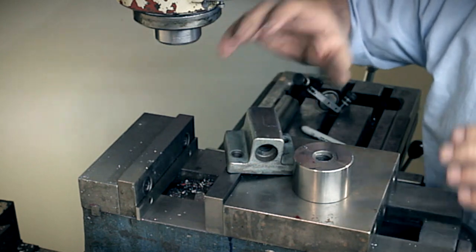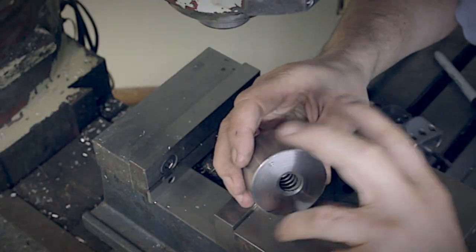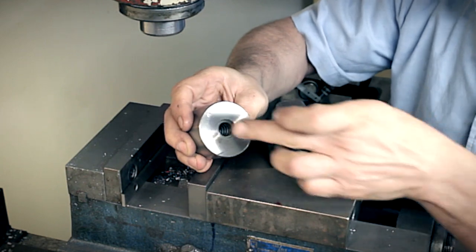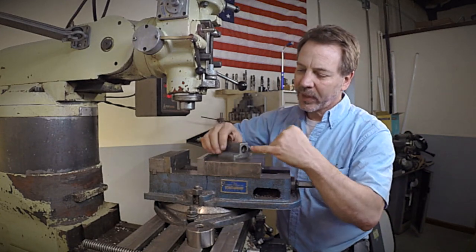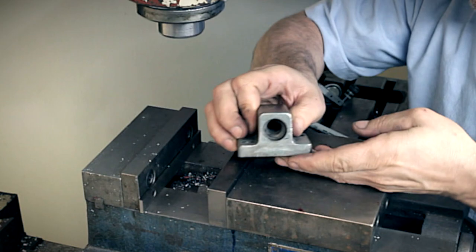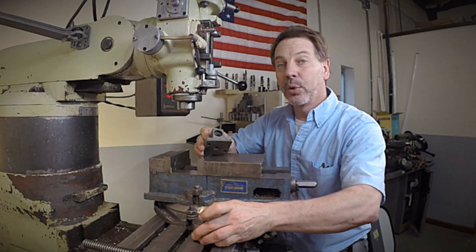What I need to do is make the nut. Just like the pre-made lead screw — or all-thread — that I got, I'm doing the same thing here. This is a pre-made nut, and what I need to do is make it fit inside here. So what we need to do is bore this out, get rid of the threads that are inside, and clear out room to put in the new threads.